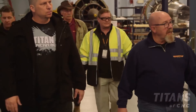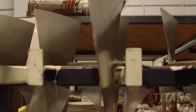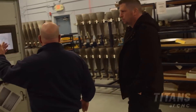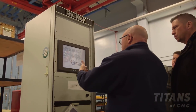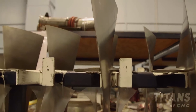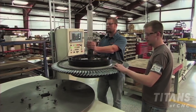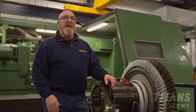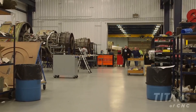For the fan blades, we take each blade, put it in this jig, and the computer looks at each numbered blade we've put in. The machine then tells us exactly where to place each one in the hub so we get a balanced run from the beginning. The importance of putting this engine together front to rear properly is paramount — if we don't do our job correctly, this engine could fail on wing prematurely, and there's no place to pull a 747 off the side of the road at 30,000 feet to make a fix.